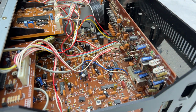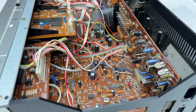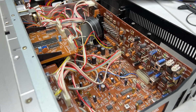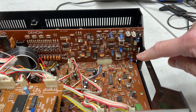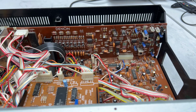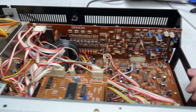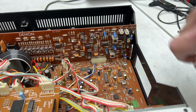But you remember that auction I won with the 93 UKZ parts? Well, that value just happens to be what this deck needed most. And there's a couple of UKZ parts on the AutoCal board now too. But the AutoCal board, every capacitor but I think 3 have been changed. I wanted to get the recording amplifier issue sorted out before I changed all of the caps, but that's probably coming now. Because that one's an old one, and there's 2 old ones down under there that I haven't done yet. But all of these over here are in the audio chain, and they're all audio-grade caps.